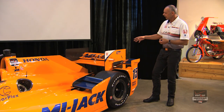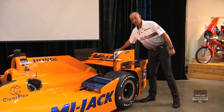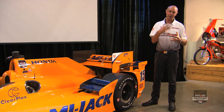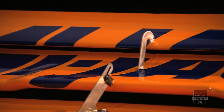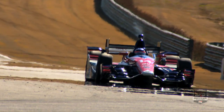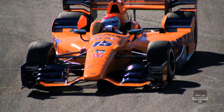Finally, on the rear is the rear wing assembly. We are allowed a much shallower rear wing box — they've cut down the height we're allowed to use. This is the stock Dallara mainplane carried over from last year. Our solution is a rather configurable rear wing assembly. On Graham Rahal's car here, he's got what we call the standard flap one and two elements. You might see in the next few races other elements appearing within the homologation box in that rear wing assembly, and those come and go depending on what downforce trim the teams want — whether they want to sacrifice straight-line speed for speed in the turns, which depends on what type of tracks the teams are racing at.